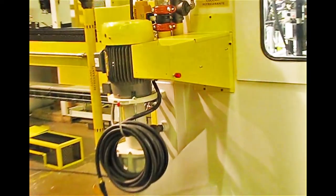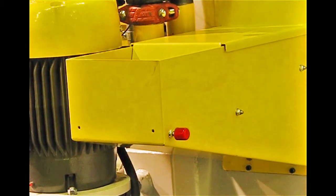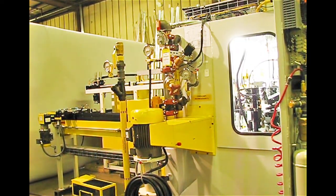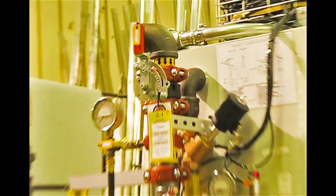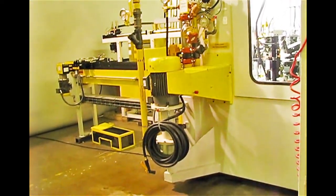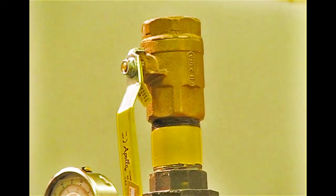Here is the quality check conveyor. When the machine is signaled to issue a quality check part, it comes out through this gravity conveyor. This is our input coolant system. This machine was designed to hook up to GM's coolant system, with fluid coming in through an inlet, regulated down, then pumped back out after collecting it into the belly of the machine through this pipe going back up to the filtration system.